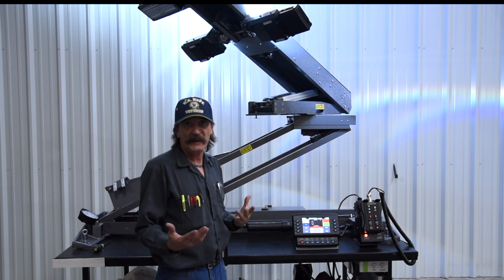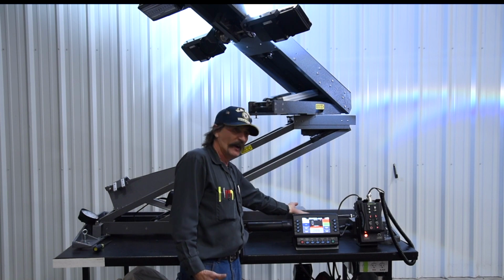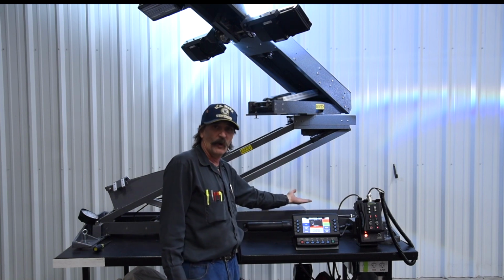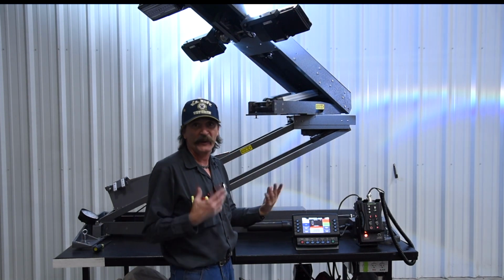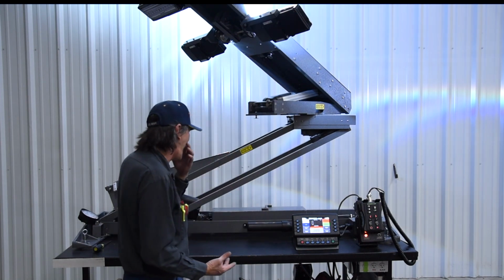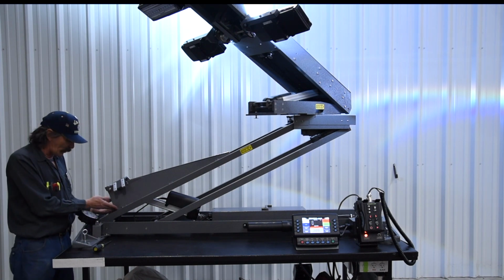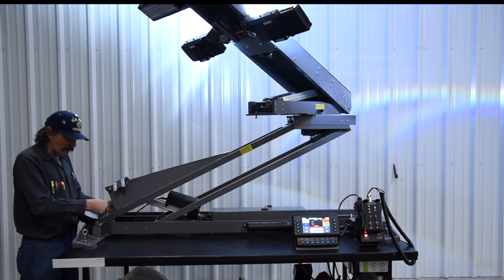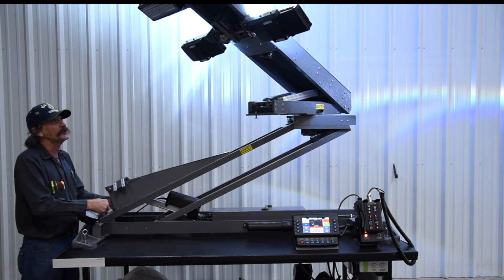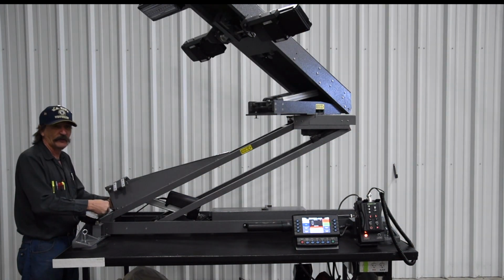It is also tied into our auto park sequence. If you do not have center in an auto park, once you come down to that point, if it does not have this green centered light, it will shut down automatically because it doesn't know where the lamp tree is at. On a command light, basically from the outside you can barely see it. It's only a little Phillips screw on the outside here. By adjusting the pitch of that switch, you'll be able to turn the safety limit, increase it or decrease it.